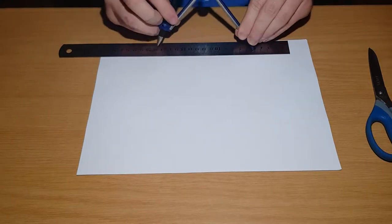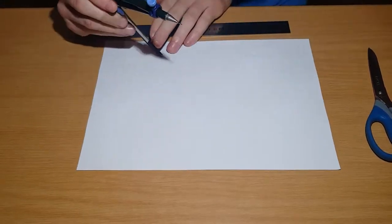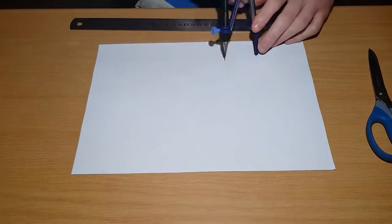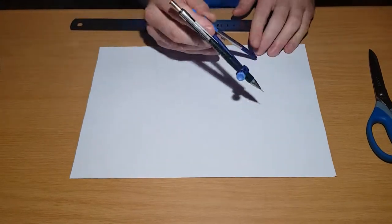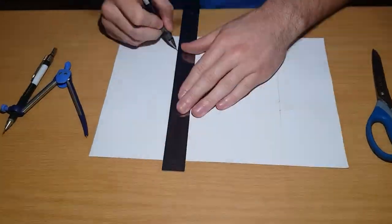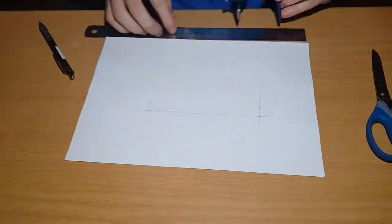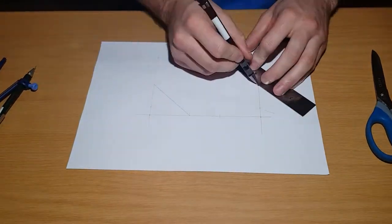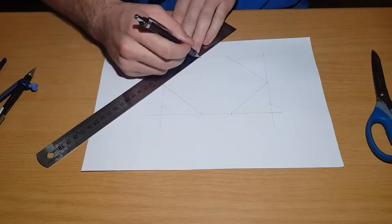Let's go and see how I did this. The first step is to make a paper template to transfer the antenna dimensions onto the metal tin. This is done using standard drawing techniques with a compass to draw arcs, distances and perpendiculars, a ruler for measuring distances, a pencil to draw, and a scissors to cut out the template.